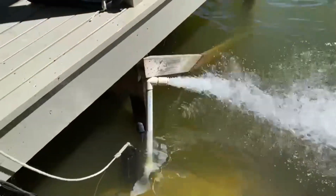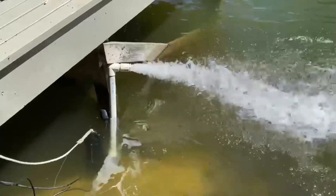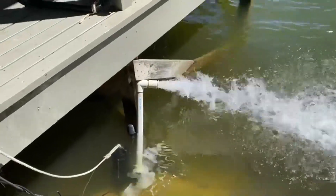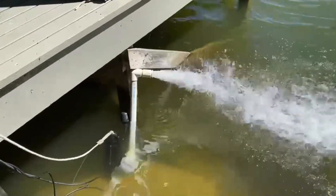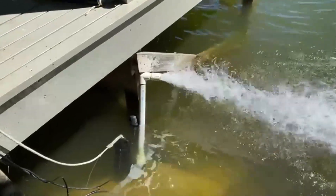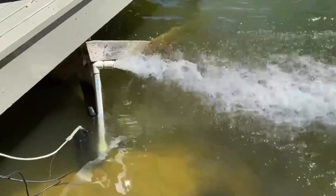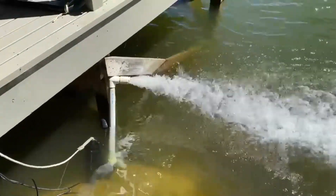This has a max head meaning it will lift water up to 29 feet — that's impressive. And doing it this way at the boat dock is a way for you in the winter to end that discharge at the pilings and keep ice from building up on it and protect your dock. I think this is a great pump and I thank you for watching my video.